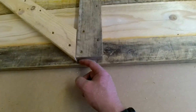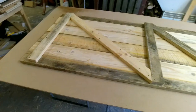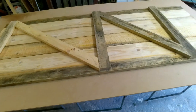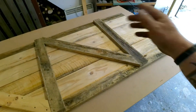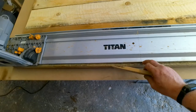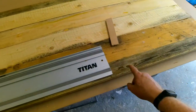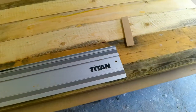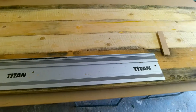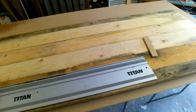I can trim down the sides now. You can see there's a tiny little bit of overhang here and on that one too, but when I trim these down to the right size that'll just get trimmed and it'll be fine. We're going to trim the sides off using the track saw and it should be the right width then to take to the property. I've got the track saw set up and I used my spacer to sit on the edge just to make sure I'm cutting the right amount off. My track didn't go right to the end so I get to around here, slide the track up, and reset to make sure I'm at the same point, then cut from further back just in case it's slightly off. That makes everything a lot straighter. I'll do this cut all the way, do the same on the other side, and then we should be good to go at 30 inches.